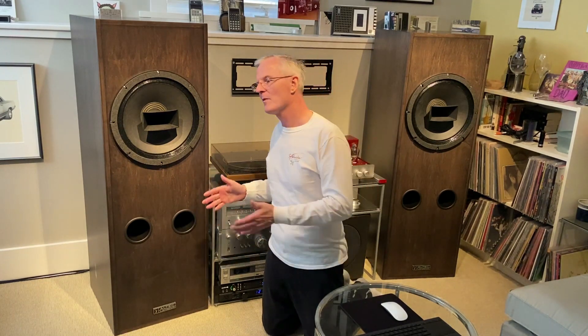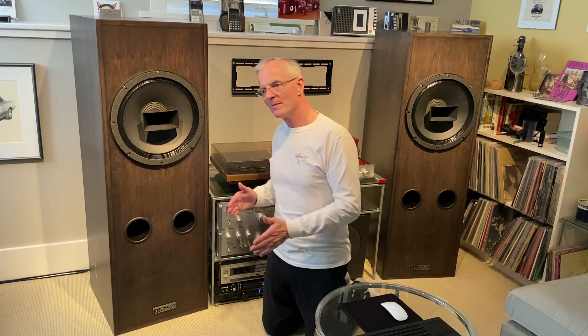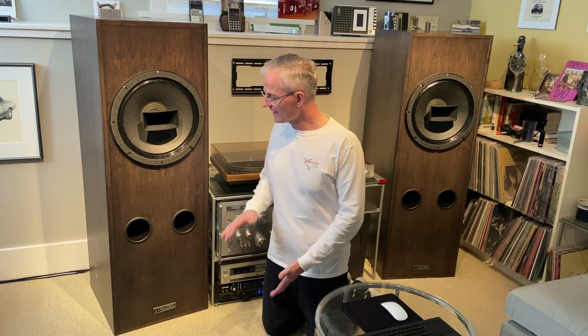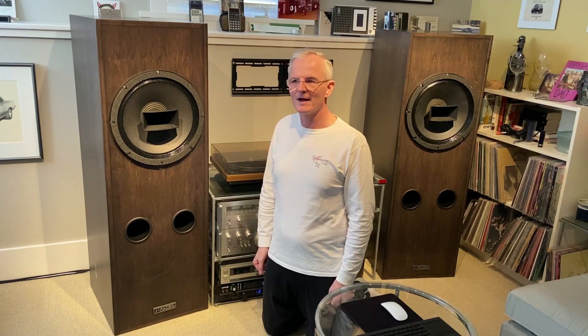Just adjust the amount of damping. If you put more damping in, you control the speaker more and it's going to tighten up the sound a bit, but you're going to softly roll off and suck up some of the energy in the bass. So you can play with that amount of damping depending on what your listening environment is like, and increase or decrease the amount of bass — whether you have a subwoofer, that kind of thing.